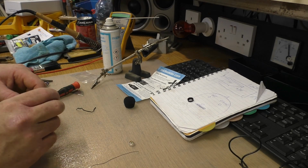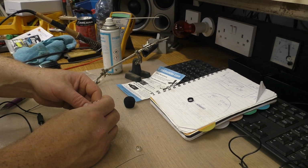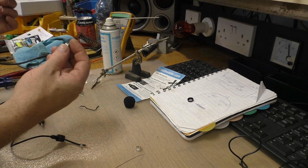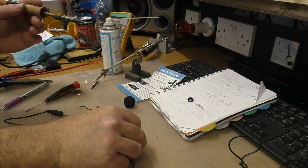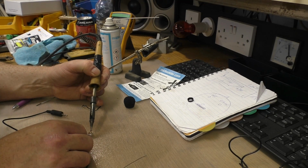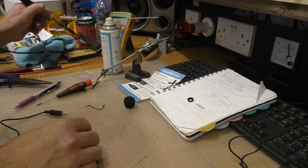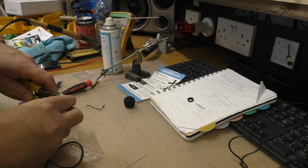Now, so we know what way our wires are around on this thing here. So we know that the copper coloured wire is our ground and that the red coloured wire is our hot. So we just get them off. We'll keep that, might make some use out of it. Now, we get this soldered on. So hot is the one on the right, and we'll do that first. Like that. And then we'll just chop a little bit off the one. You don't want stray wires anywhere.